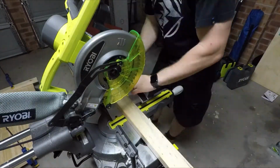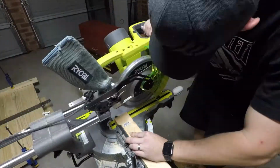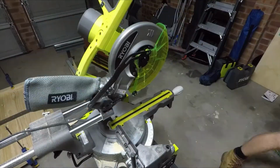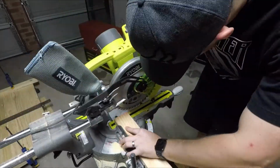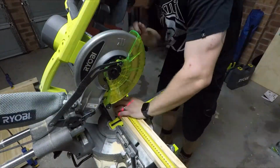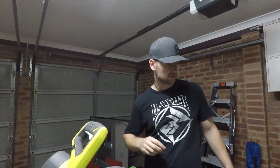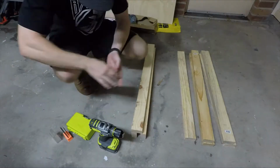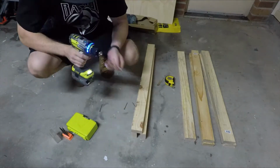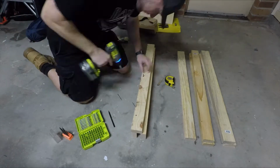Trap for young players, I realised after cutting everything that I need to adjust the saw blade slightly so that it makes proper 90-degree cuts. That's 4 legs. Let's screw them together. Here I used a separate piece of wood to give me something to press down onto while I was screwing the bits together. I also pre-drilled everything before screwing to avoid splitting.